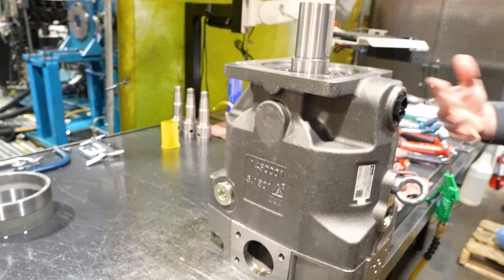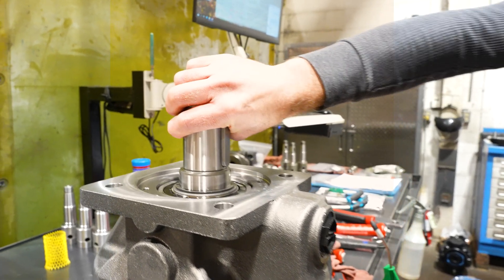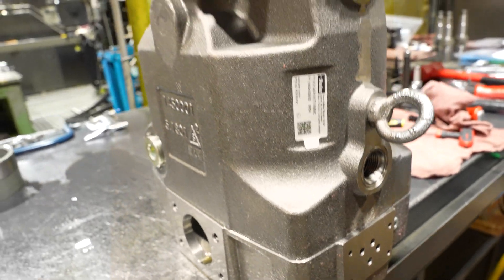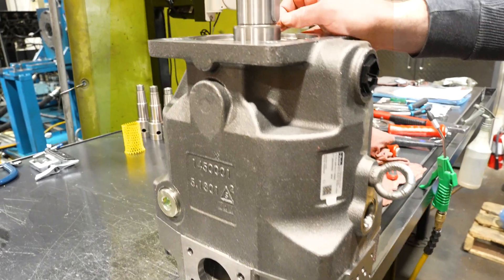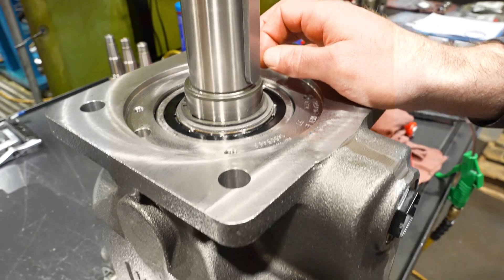It just forces the pump to stroke with air. It's a 50mm shaft, so the key is designed to take the torque of the shaft. I wondered if air would work, and I've been doing that for a while now. I put it back together and now I know it strokes - so when I put it on the test bench I don't have to worry about it. There's nothing binding, it's completely free - it stroked with about 130 psi of air.